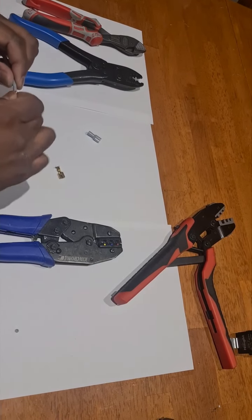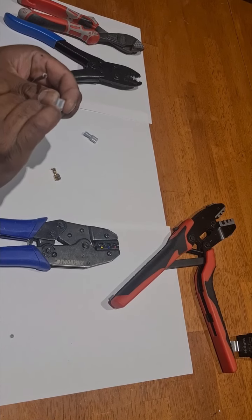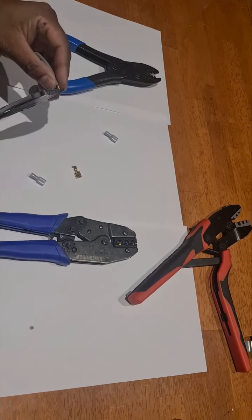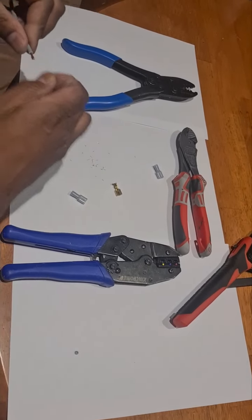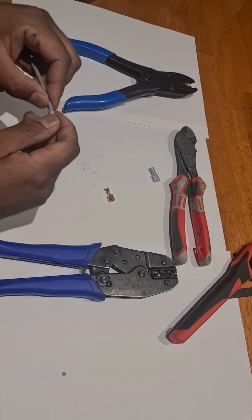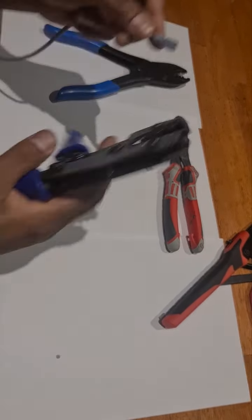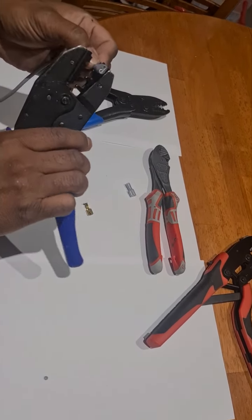When using an insulated terminal, I like these K-back terminals because they actually have a guide that stops the terminal from going all the way in. We need to trim this one back to size. Once trimmed, we just make sure it's a nice even connection and that it is seated nicely into the sleeve. This crimper has three different sizes — yellow, blue, and red — and the one that fits best for this application is the red one.